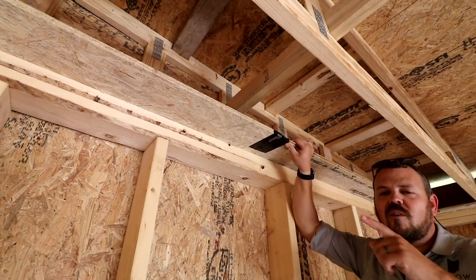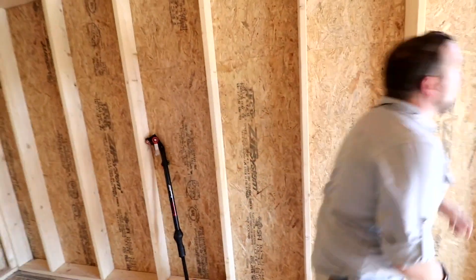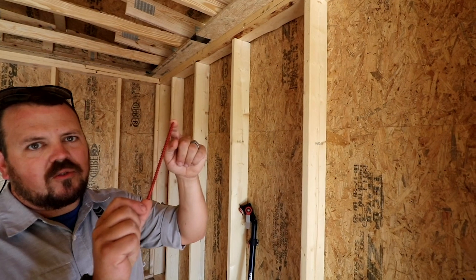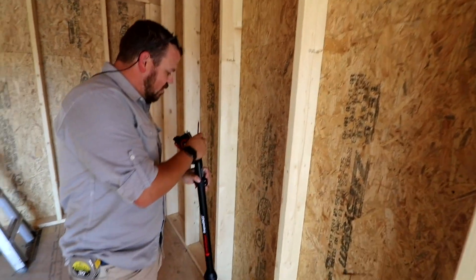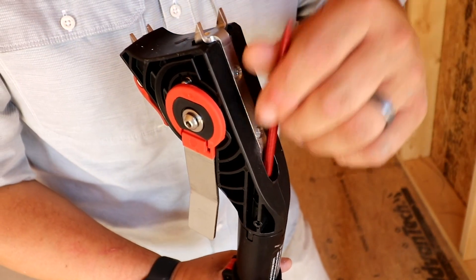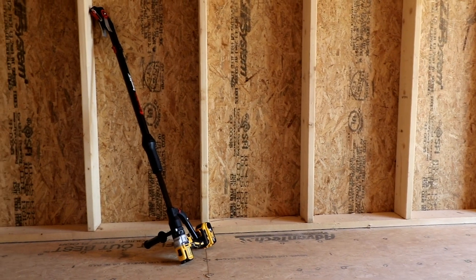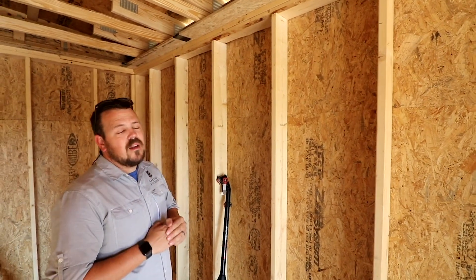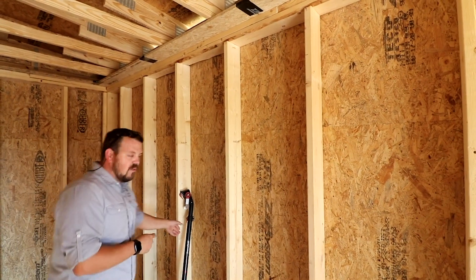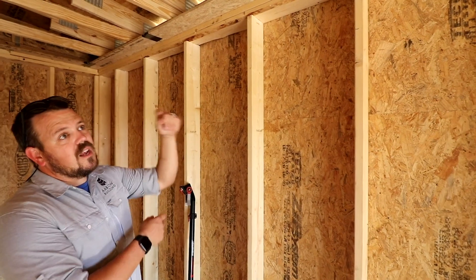Now, if you paid attention a second ago when we were downstairs — those hurricane ties — we have another issue. How do we make that hurricane tie connection if we've blocked off that spot? The answer is a truss screw. This truss screw, when paired with the new gun we got from Fasten Master, I can now install those from the ground. I don't have to go up and down the ladder to make all those connections. I checked and we're able to use that screw in conjunction with the three-quarter Advantech because we did lengthen it. You need to check with your code officials because it depends on what wind zone you're in — that's an uplift issue. But now we have the ability to fasten from the ground, and we have that air barrier connection.